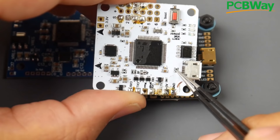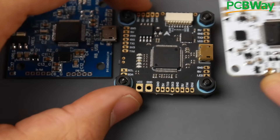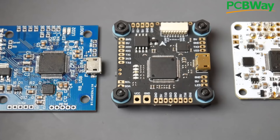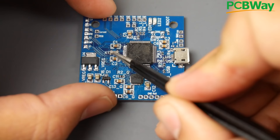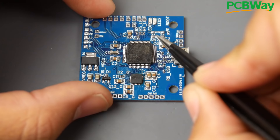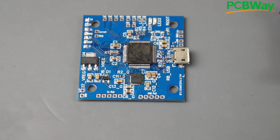You'll see those two 22-ohm resistors on every board — here they are, and here as well. That's really all you need: two 22-ohm resistors and a USB connector. We'll get into where the pins go in the schematic video. The most important components of a flight controller are the gyro, microcontroller unit, resonator, 3.3V regulator, some capacitors and resistors, the USB, and possibly a boot button — though the boot button can be done just by bridging two pads.